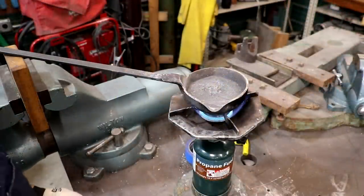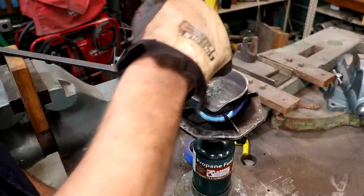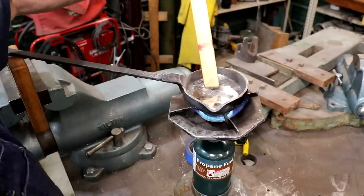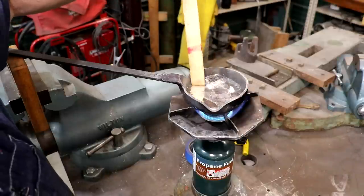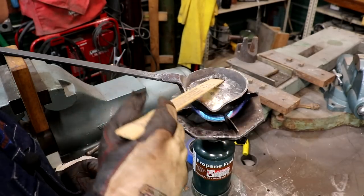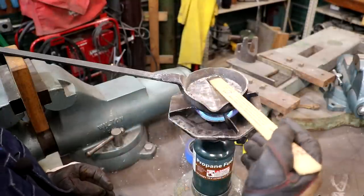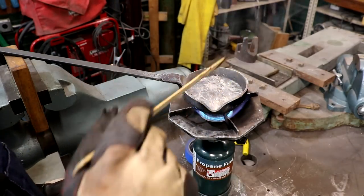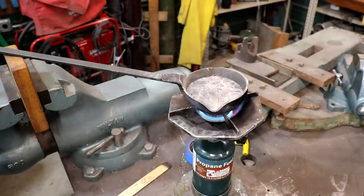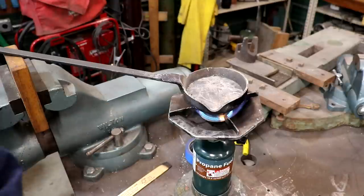I've got my Babbitt simmering over here on the stove. We just melted this in the ladle - I've just got a little propane stove. I usually will take a pine stick or a paint stick like this where you can kind of just pull the dross off the top. This is just any kind of trash or impurities that are in that Babbitt. As far as pouring temperature goes, typically if you'll put this stick into the Babbitt and it starts smoking or catching on fire, it is at temperature to pour. We are at temperature to pour. I'm going to go over and heat up the bearing shell, then we'll come back, re-skim the top of that, and we'll pour that bearing.